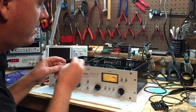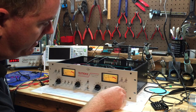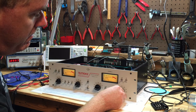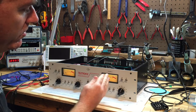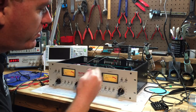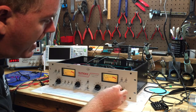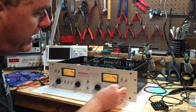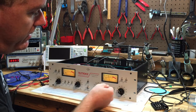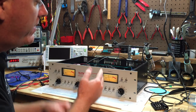You could experiment with values a little more to fine-tune, but it's not bad. The meter won't be accurate at every gain reduction level, but it will be close. I like to calibrate at 5 dB and that way you're in the ballpark. At higher gain reduction like 10 dB it won't be perfectly accurate, but at 5 dB it looks good — showing 5 dB gain reduction.